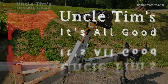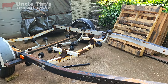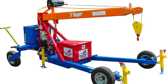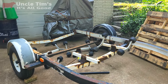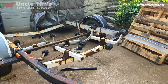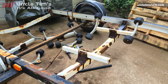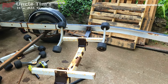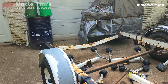I got myself a boat trailer here and no, I'm not getting a boat. My plan is to turn this into a mobile boom crane that I can use out in the pasture when we process beef — process it right out in the pasture. I'm disassembling it right now, taking off these rollers, and then I'm going to build a platform here with hydraulics on it and then add a boom to it. That will go out the back end, and then I'll have to put some outriggers that fold out off the back end there to give it some stability.